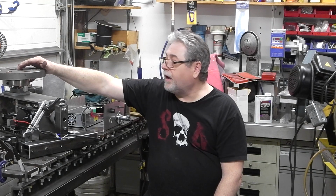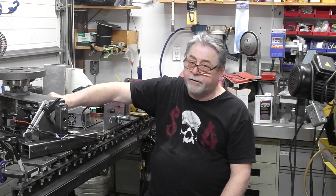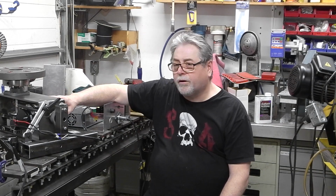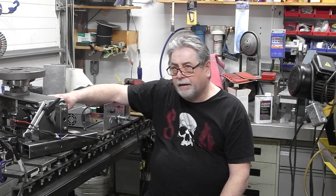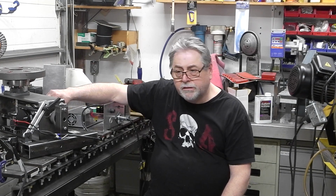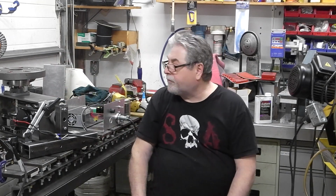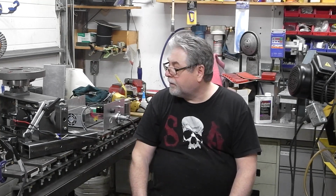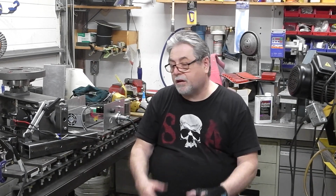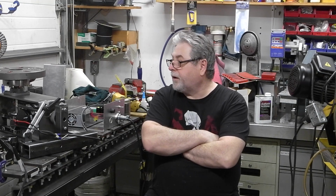But like I said, I'll put part numbers. The worm gear is 100 to 1. It came from Princess Auto. The gears, I think they were about 60 bucks, from Ontario Belting. The motor was, I think, like $32, including the shipping, from Amazon or Wish or Banggood. And the rest of the stuff, like bearings and that kind of stuff, again came from Princess Auto. So I will put something at the end if I can find the number for the worm drive and the motor. I just searched, and it was a salter motor or a scooter motor, same configuration.